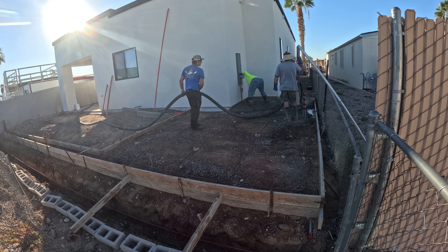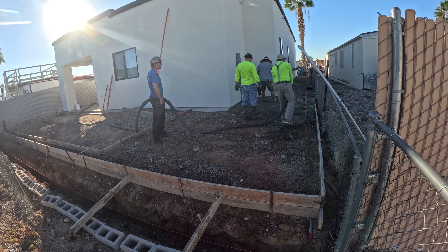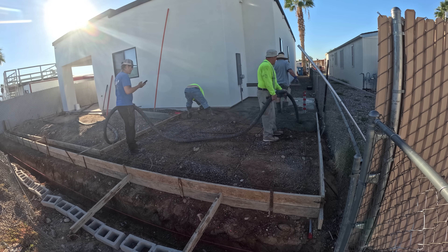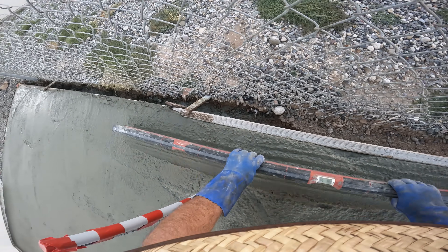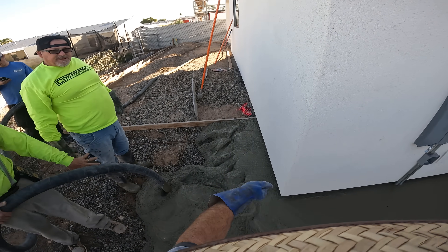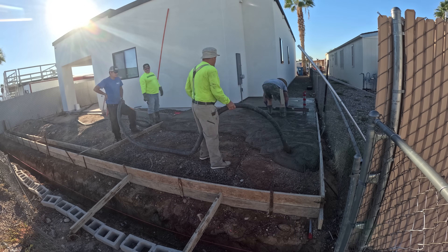We have a little bit of a break point at the corner of the house — it slopes to the left from the corner of the house and to the right from there, so that's your break point. We've got a six-foot Milwaukee Red Stick here — basically a level that's designed to be able to screed or rod concrete with, and at the same time you can check level on the way out.